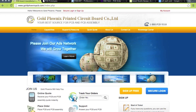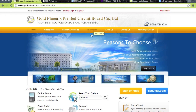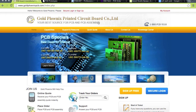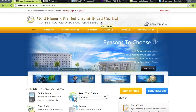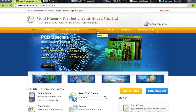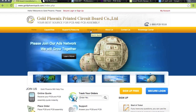There are quite a few different places where you can get your board manufactured. One of the most common and popular ones is called Gold Phoenix PCB. Their quick online quote feature doesn't actually work properly, but if you log in, you can get a proper quote — about $130 with a custom solder mask color like blue or red, or $110 for 10 boards with just standard green.